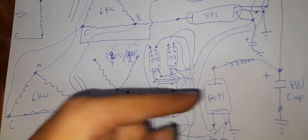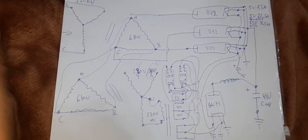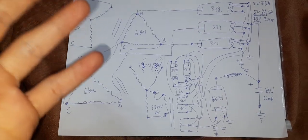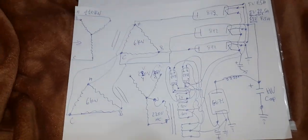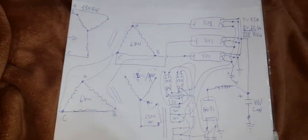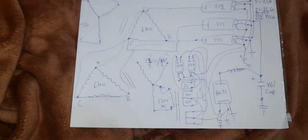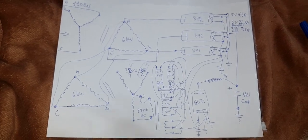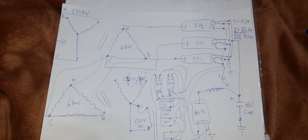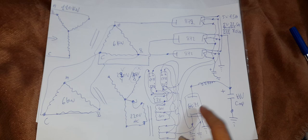of the GK71 transmitting tube. So this is, guys, how a transmitting station was working inside this substation, because you need a communication way to dispatch the faults and grounding faults, over current relays or something like that, phase to phase, phase to ground, cable breaking, jointing breaking, substation floating. So you need to communicate with the central, so you need a radio transmission.